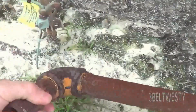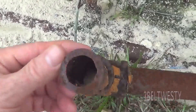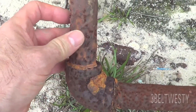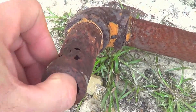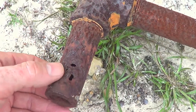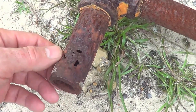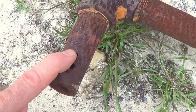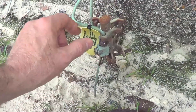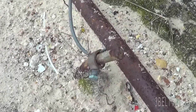Since then it's been corrected. This ground was also a gas line here — what's left of it is down here. It accelerated the corrosion on the gas line, so this has been abandoned. This is a gas line that went from the meter to a hot water heater and it was run through the ground, which I don't think is up to code anymore. Because there were currents flowing where they shouldn't be, it accelerated the corrosion rate.